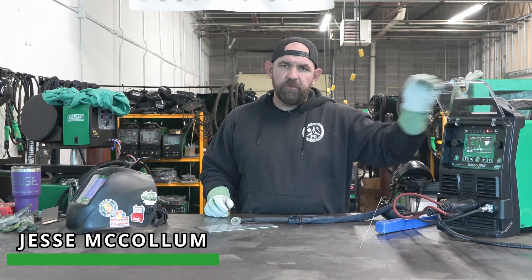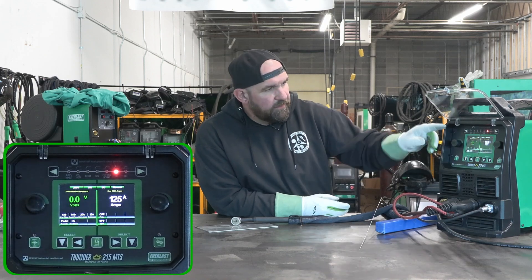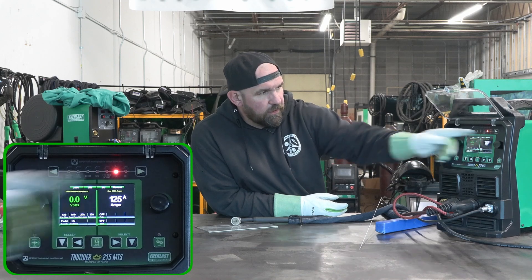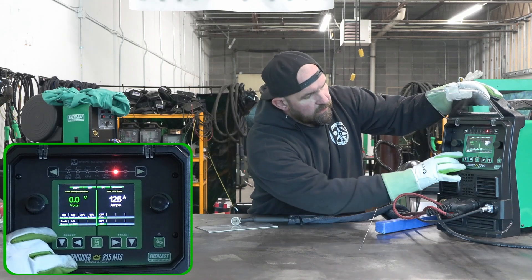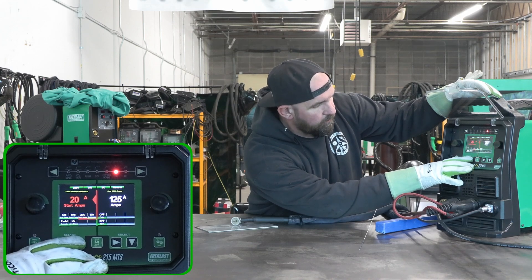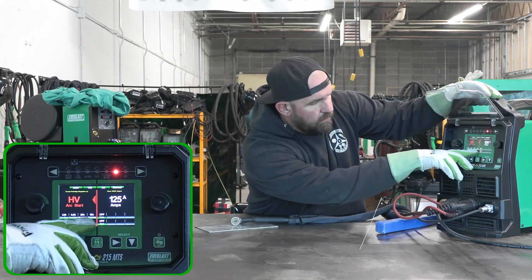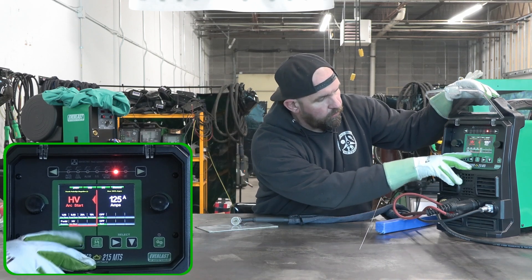Today we're on the DC TIG side. Across the top of the menu we have 240 volt TIG DC manual — this is a DC only machine so it's always going to say DC. We are on our TIG function. In the menu we are at one second of pre-flow, and nine seconds of post-flow — that's a lot for what we're doing, so let's turn that down to eight seconds. We've got 20 start amps and 10 end amps, and we are on pedal for the remote control.